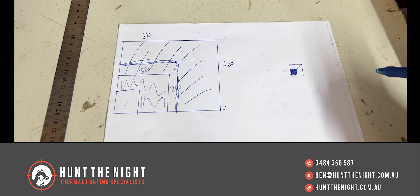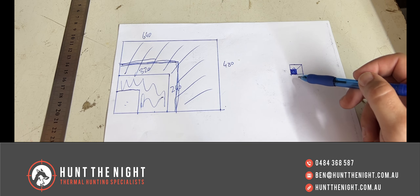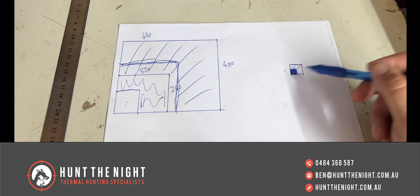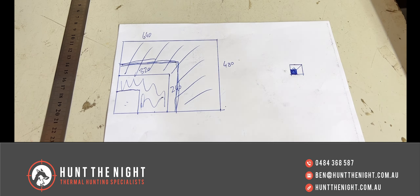The stretching of the screen is actually the only reason why, in base magnification, a 640 sensor looks a little bit better than the 384 sensor - because the 640 just fills these pixels a bit more. But if it were just a raw sensor feed it would look identical - we explained that in a different video. Anyway guys, I just wanted to delve a little bit more into that. I hope you find this useful - give me a like, give me a comment, give me a share, and tag a vegan. See you on the next one.